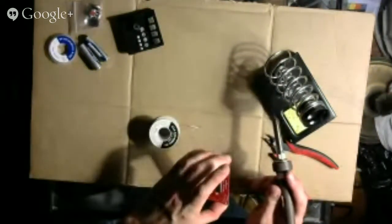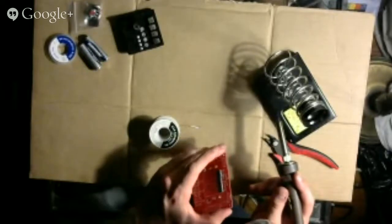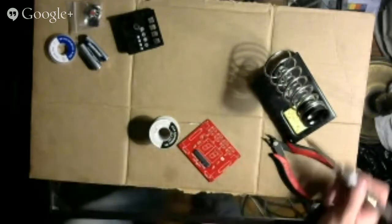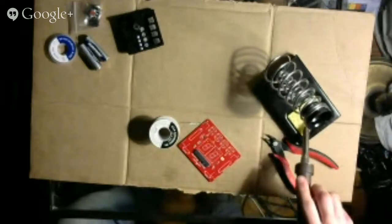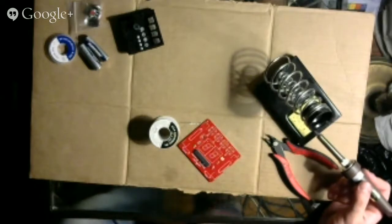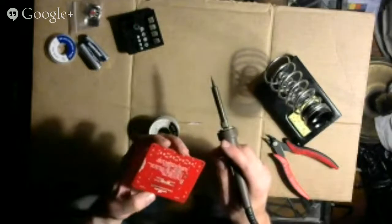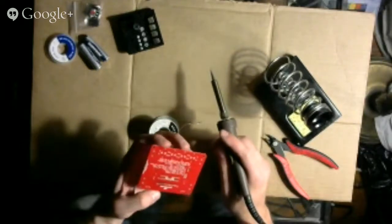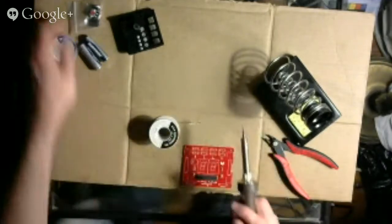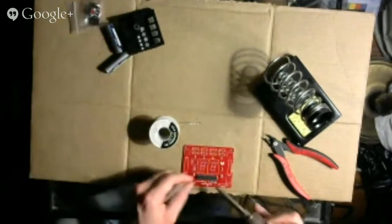Oh, shit. Okay. Well, what I'm seeing is that the solder is flowing to the other side of it. Still haven't figured out how to prevent that from happening. I think the reason that may be happening is because I'm pushing the solder onto the metal bit itself. All right, so let me use this solder wick to clear away some of this solder.